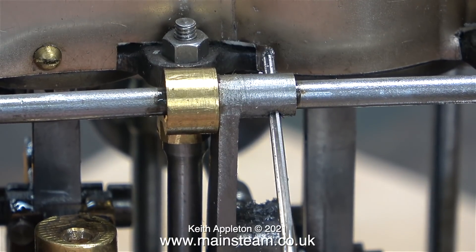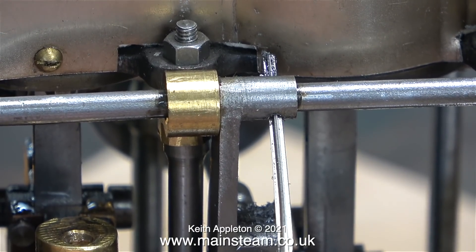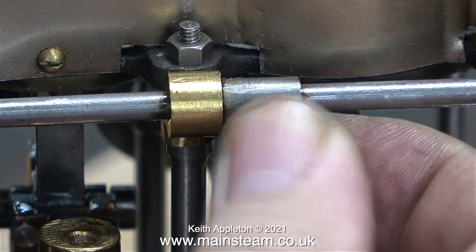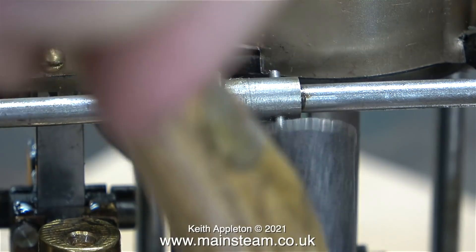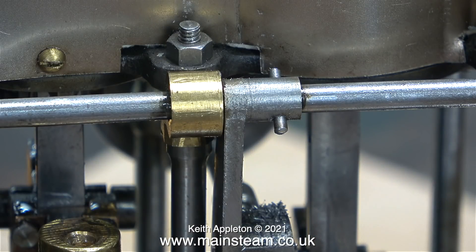It's very important to make sure that the hole is fully tapered on both sides. After reaming the hole I cut a taper pin to the right size and gently tap it in place — you don't need to use any brute force when doing this. Think about the taper on a tailstock chuck that fits in a lathe: once it's fitted into the tailstock quill it doesn't need much pressure to make it really solid.